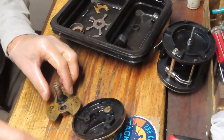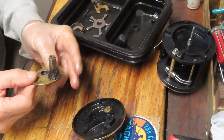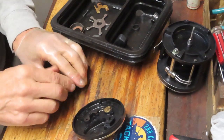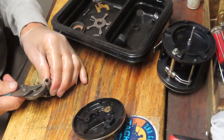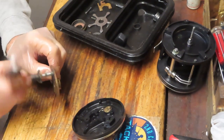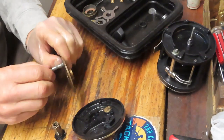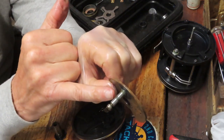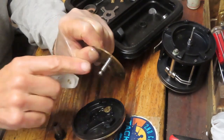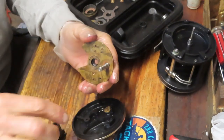One thing that wasn't done was removing the gear sleeve. You push a pin out on this side that holds into a ridge on the gear sleeve itself — sometimes you need to pull it out a little more. You can take it out all the way, but I like to leave it seated if I can; it makes reinstall easier. You want to remove the gear sleeve because a lot of times you'll find dried grease in that crevice. There's a channel in there, and this groove is where the pin rides for the gear sleeve.